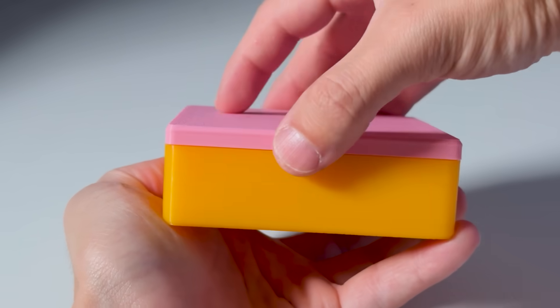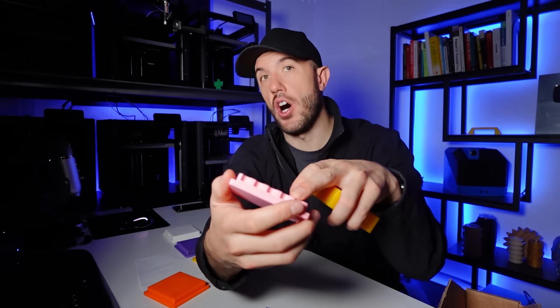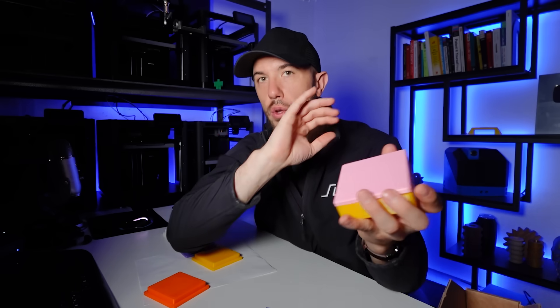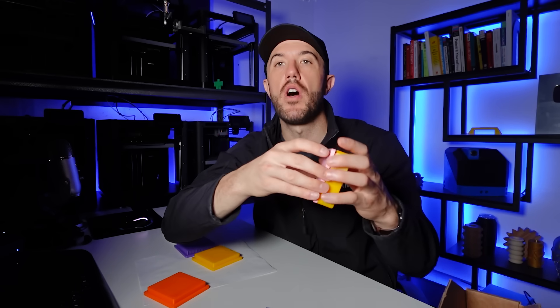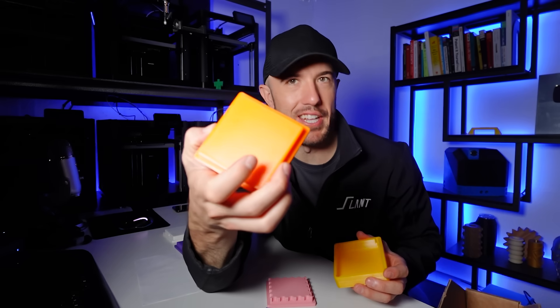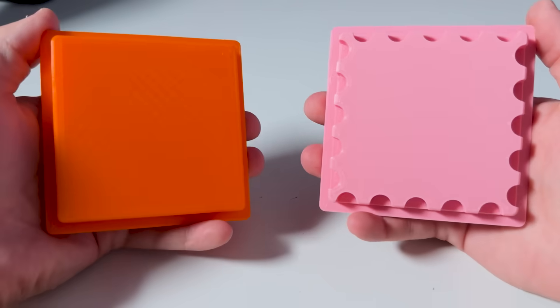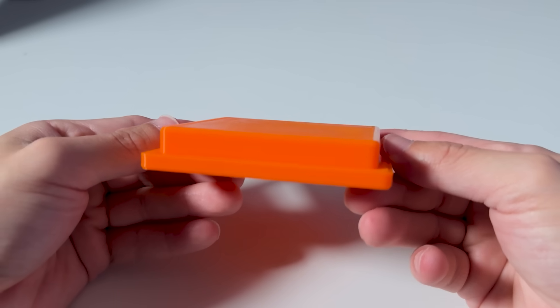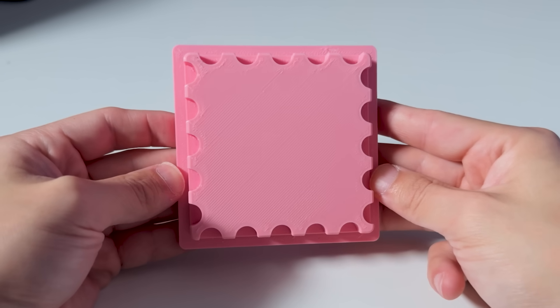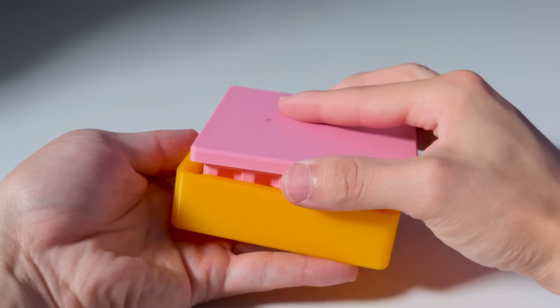You can make a tighter fit but still have it kind of loose. You can take this all the way down to a single nubbin so that it just shoves right in there and there are only a couple of points where it's making contact with the walls, so it's easy to open back up. But if you want it to be permanent, go ahead with a solid version. Solid versions aren't very useful because they don't change dimensions — they don't have a lot of flexibility or extra tolerance when pushing two things together.